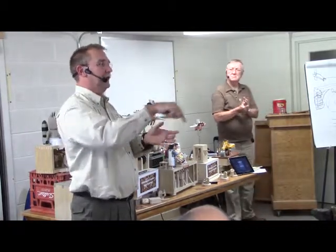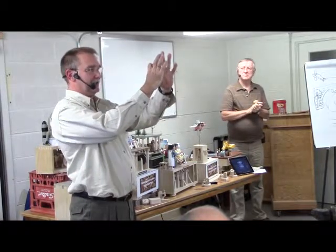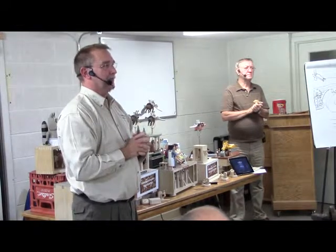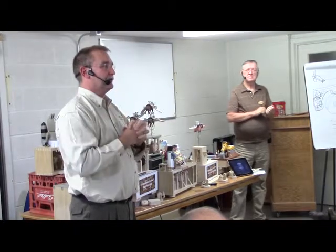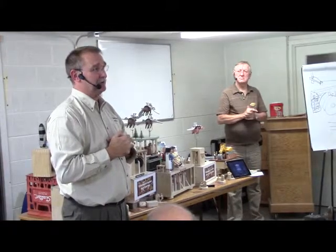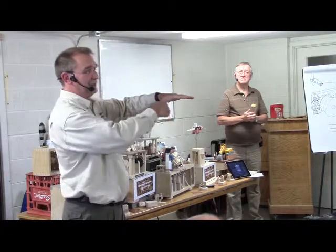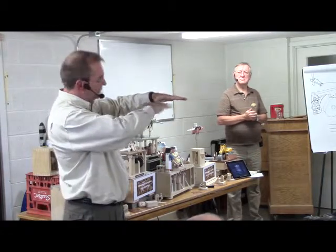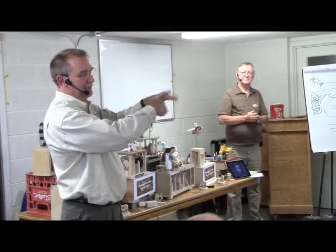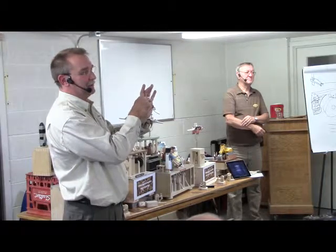I'd drill a hole, and then I'd go to the outside line. So when I'm cutting a disc that big or sanding a disc like that, I locate it with a piece of paper on a stickum. There's lots of stuff on the internet about how to find the center of a dowel, because that's a problem I get into sometimes. Find the center of a 1-inch dowel. Most of the time, I'll put the dowel on my table saw or a flat surface, take a block of wood, maybe a half inch or something, draw a line, rotate the dowel, draw a line, rotate the dowel, draw a line, rotate the dowel, draw a line, and sooner or later you're going to get the center close enough that maybe you can put a drill on it.